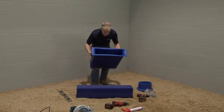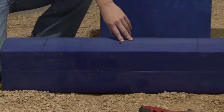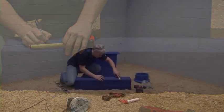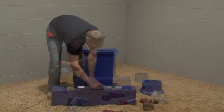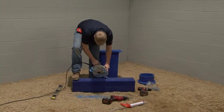Mark the sides of the diffuser adapter on the linear diffuser on the side with the hole in it. Measure and mark ¾ inches in from the outside dimension of the linear diffuser adapter. Use a straight edge to draw the inside dimension using a black marker, then cut out the inside of the marked area.